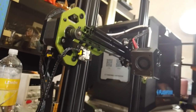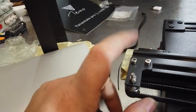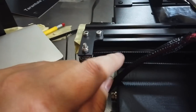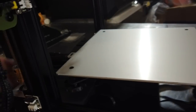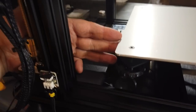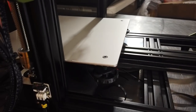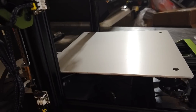The only mistake I made is the belt might be a little too short — my pulley doesn't go all the way back, so I may need to loosen the belt to slide it further. We'll see if that affects build volume too much. I can go all the way to the end of the bed and all the way to the front, so I'm not too worried. Time for first power up.